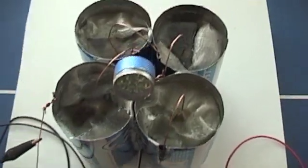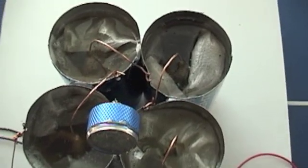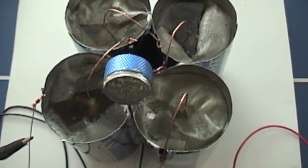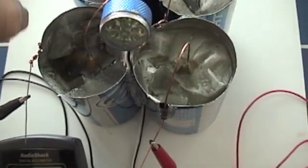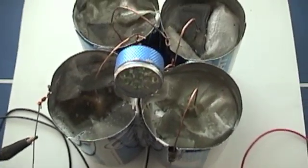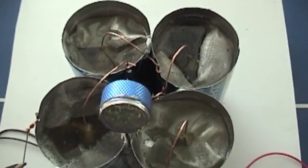It's really easy to make. You just drill each of the briquettes, run a copper wire through it, wrap it with paper towel, fill it with seawater, and then connect positive to negative in series — and you can light a single LED easily off each of the cells.